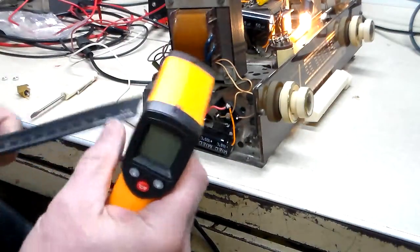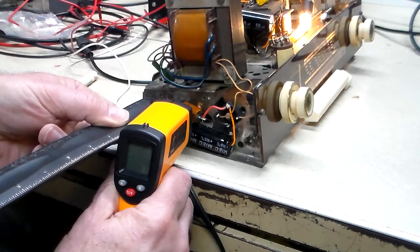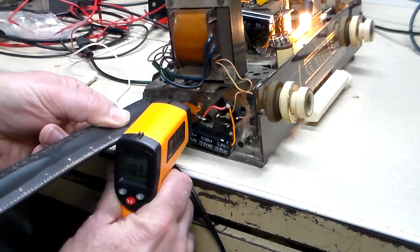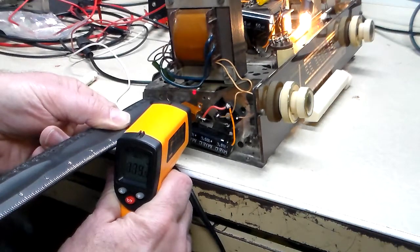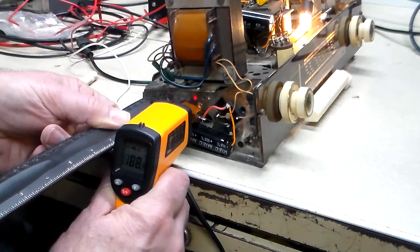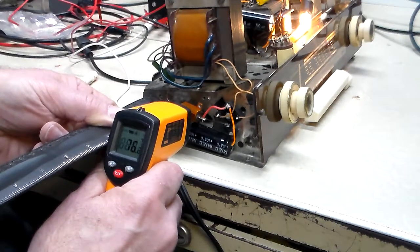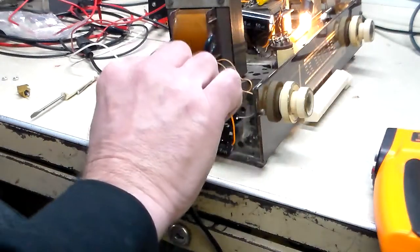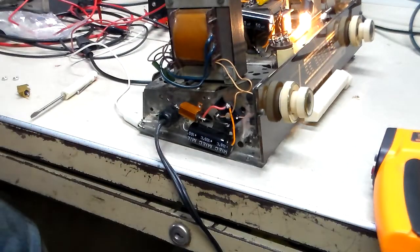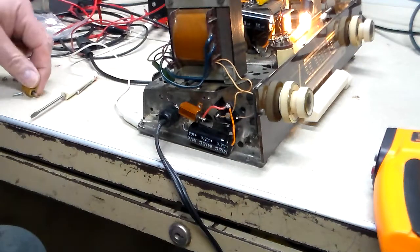We'll start again around an inch and a half out and I'm going to scan around for the highest temperature. At about an inch and a half: 158, 159, 170, 170 — and then it's dropping back down. Right at the edge of the frame it's about 175. When I point right at the top of the resistor it's saying about 104. When I point right in the middle of the resistor it goes down to about 76 — which I know is definitely warmer than that. It's definitely hot to the touch.